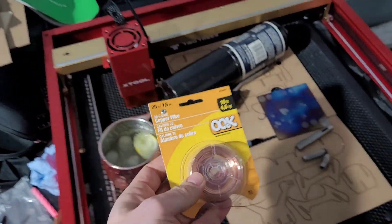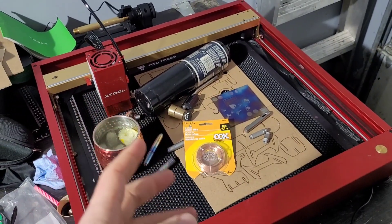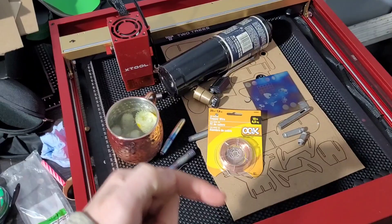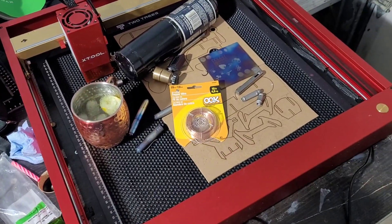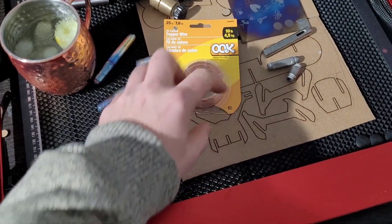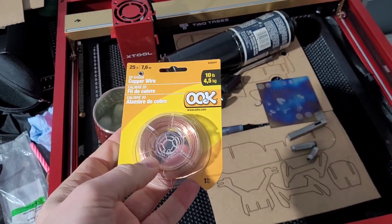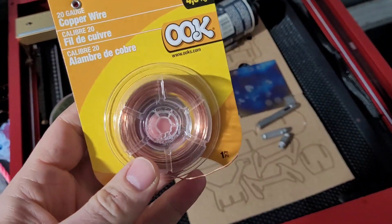One really cool method of manufacturing — if you can design your part to incorporate it — is very cost efficient, and that's to make something out of wire. They have four or five axis CNC machines that feed out the wire or rotate the part. That's how springs and all sorts of things are made. If you go to the dollar store, a lot of those baskets and little things are done with wire. There's no waste — there are giant spools of wire, usually steel or whatever, and they just spit out the parts, get chopped off, no wastage. It's cheap material, so it's a very cost-efficient way. I don't have one of those machines, obviously, but I would like to make a pen out of wire.